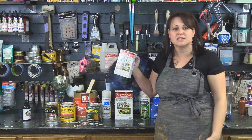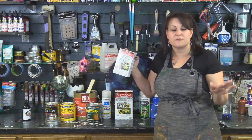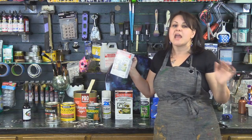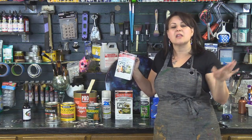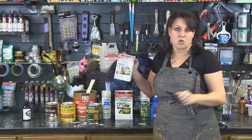Well, I'm just going to make this a satin piece. And that's how I decided that it looked beautiful like that. So I am able to get both a satin finish and a high gloss finish with the glaze coat by just taking the additional step of giving it a light sanding with my orbital 2 days after it's poured.